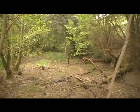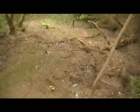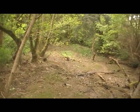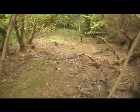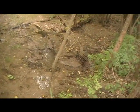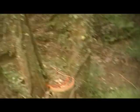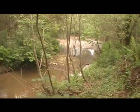We're at the very top of what starts as the ram pump system. This area here, when dug out - when it should be all dug out with debris and whatnot cleared - would act just a bit like a dam, and this would act as a sediment catchment area, so all the bits and pieces would just get stuck up here in the mess there. And if there is too much water coming down, then there is an overflow chute just here. This here runs down into what would become the main dam.